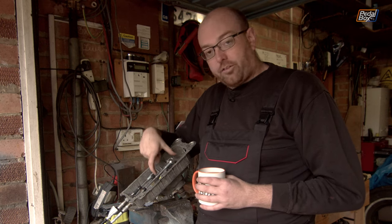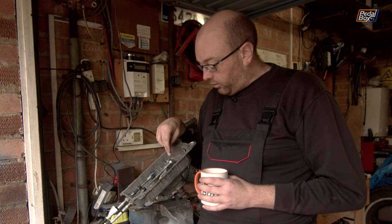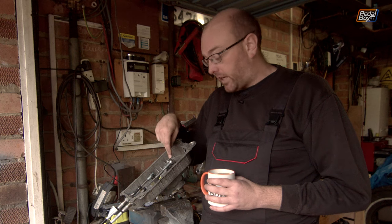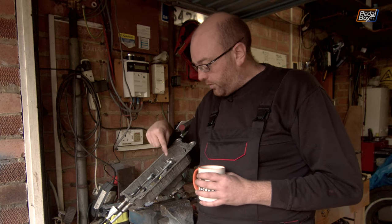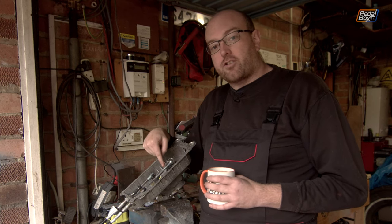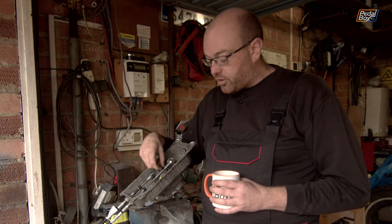When we have enough throw on the forwards and backwards motion onto this ball joint here, the ball joint goes through fine. We actually drilled the old mounting out, which is down here. So remove that completely, drift it out, all good, and we just put this ball joint in that came with the cable, but we had to extend with an extra piece of M6 threaded rod and a join nut with some extra jam nuts on.